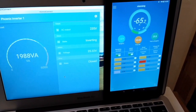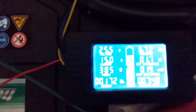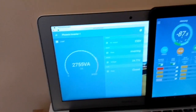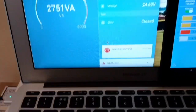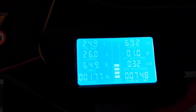It's brought in the contactor — about 65 amps coming out of the lithium and about 15 amps out of the lead acid. I'll bring in the heater as well. Now it's taking it up to about the maximum you could run it at — in fact it's coming up with an overload warning. We've got 90-odd amps coming out of the lithium and 26 or 27 coming out of the lead acid.